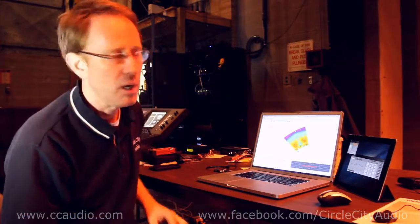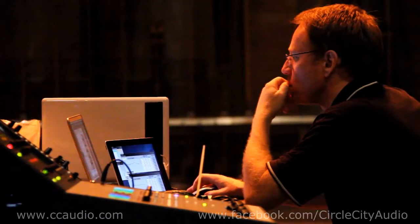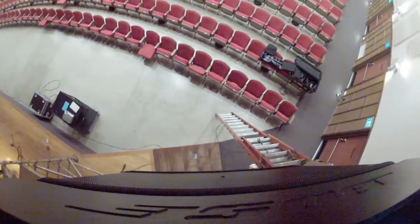On the loudspeaker side, we did use the Bose RoomMatch. I modeled the room using the Bose Modeler system and listened to it with Auditioner. RoomMatch was the right option in this situation. We needed a dual hang line array product that let us control the pattern vertically and horizontally, which RoomMatch is the only one that does, so we can put the right coverage in the right areas of the room.